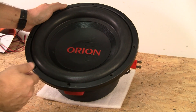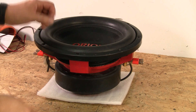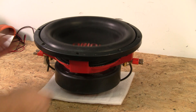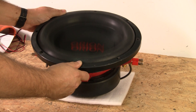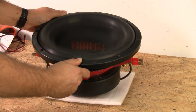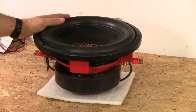And here we have our finished product: an HCCA 12 rebuilt to look as close to the original as possible with slight improvements to the spiders, the leads, and the surround. Now we can put it on the test bench to make sure everything plays fine — no rubbing or any other funny noises. And there we have it: everything is fine, no rubs, no funny noises, no pops. This will be ready for the customer after I build another one just like it.